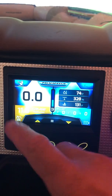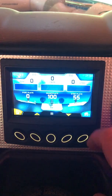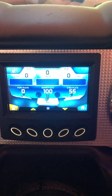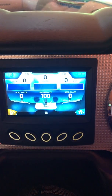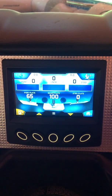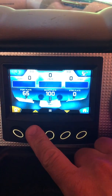If I hit this button which shows the ballast levels, I can see that my plate has deployed to 55% on the right hand side, or starboard side of the boat, so that it can surf left. Conversely when I switch it to the other side — starboard surf for goofy footers — the plate has deployed on the port side. A lot of people don't even know how to adjust this plate deployment.